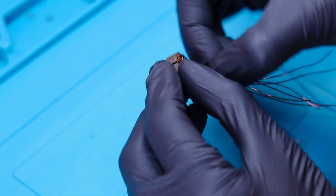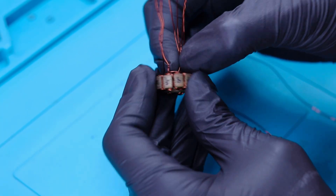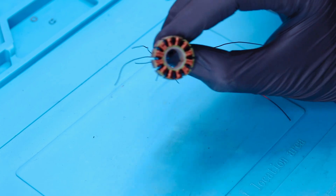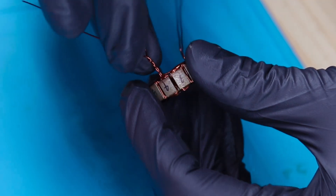We have three pairs of two wires which we have to put together. It does not create any confusion about which wire goes with which one, because they are all coming together at the same slot. If you twist the wires like this, it will be very easy to solder the silicon wire.